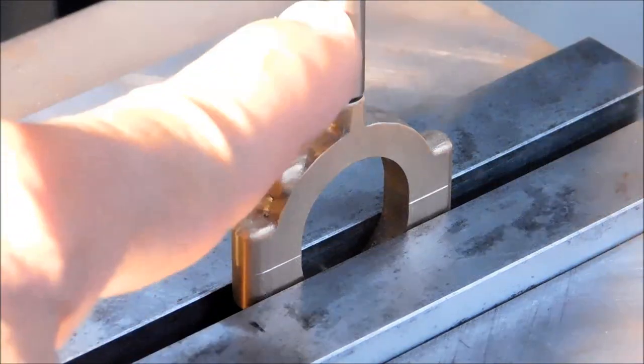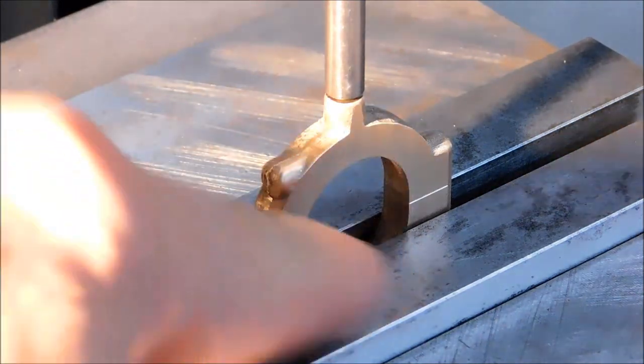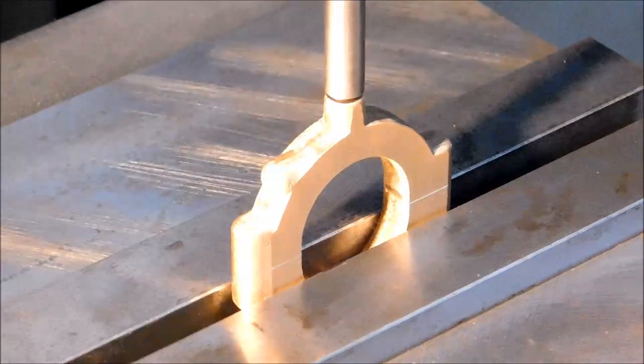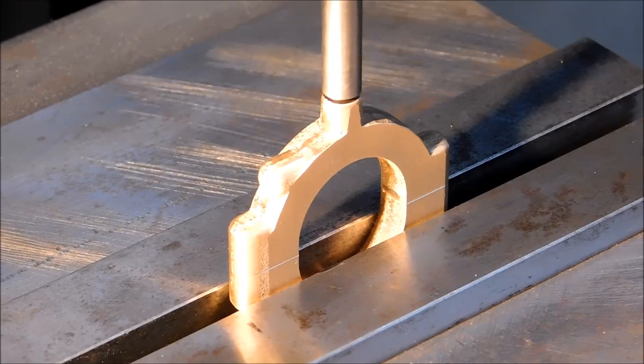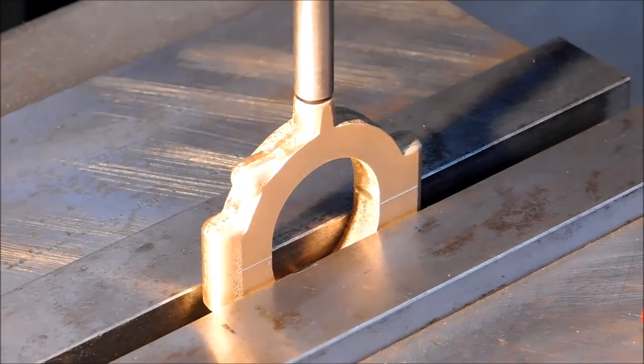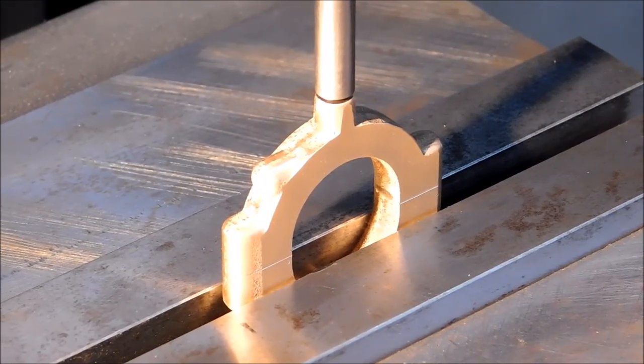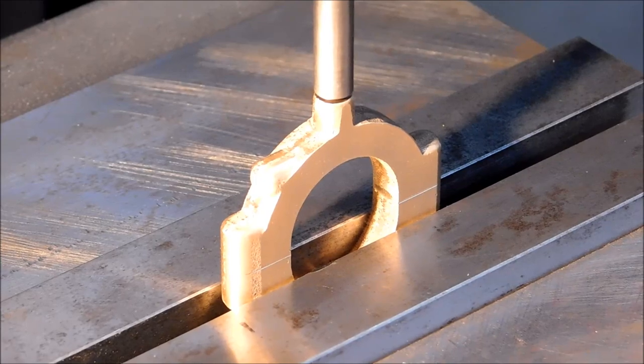That is the only way you're going to guarantee that the center of this rod is in the center of that hole. But knowing that this controls linkage that goes through a U-joint, that U-joint is going to cure a lot of problems and absorb a lot of imperfections, if you have any, at that point.